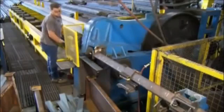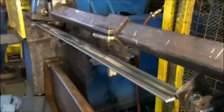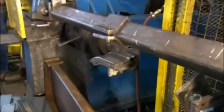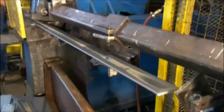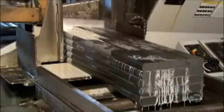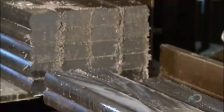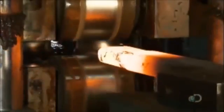Production starts with spring steel. It's an alloy that has elasticity. Big shears cut the steel to various lengths for a multi-leaf spring. It's one of two kinds of leaf springs. Using a bandsaw, they cut steel for the other kind of leaf spring known as a full taper spring. It's made of 1 to 4 leaves that are approximately the same length, but various thicknesses.